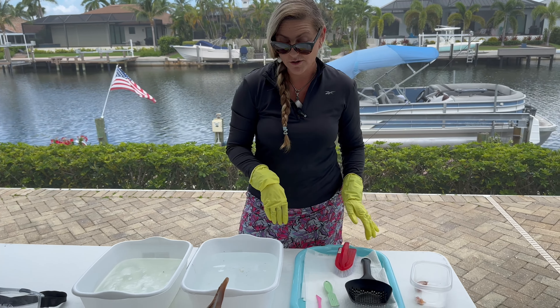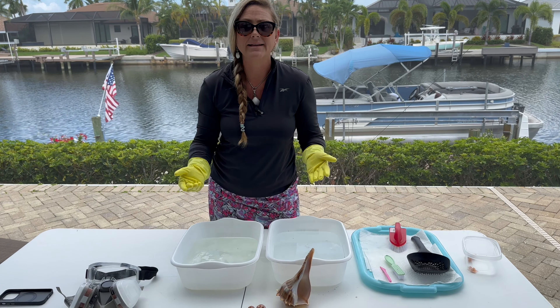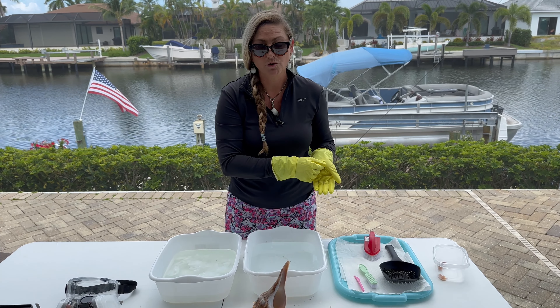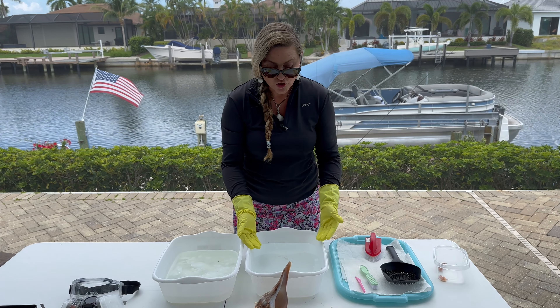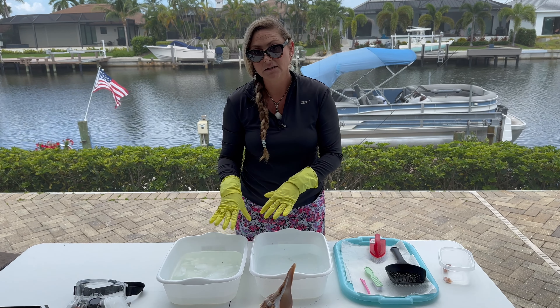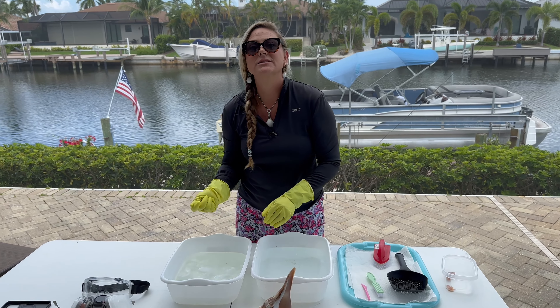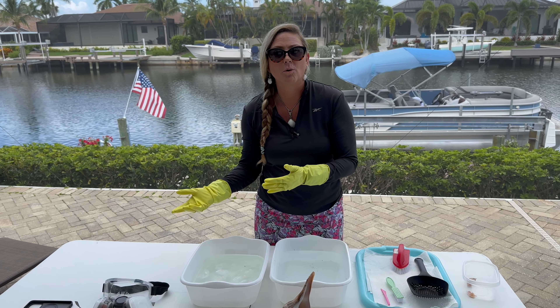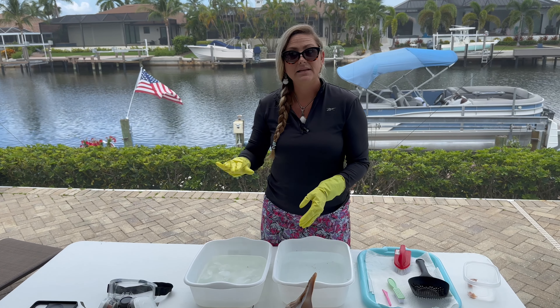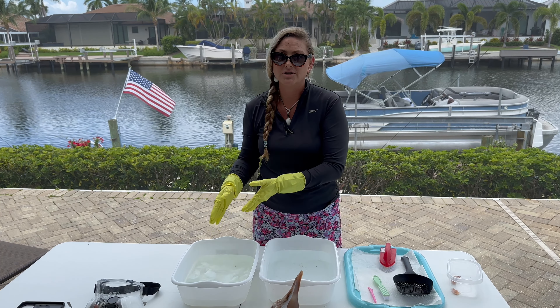Dollar Tree tools and muriatic acid — you're going to get that at your local Ace Hardware, Home Depot, Lowe's, or Walmart, typically in the pool section. Less is more — you can always add more. I'm going to neutralize the acid water with baking soda. About a cup of baking soda is what you need. You don't ever want your water filled too high when you neutralize the acid because it will bubble over. Try with a little bit less baking soda, let it neutralize, put a little more, and make sure it stops fizzing. We throw it in our rock beds around the house so it's not seeping into the waterways — very important to neutralize your acid.